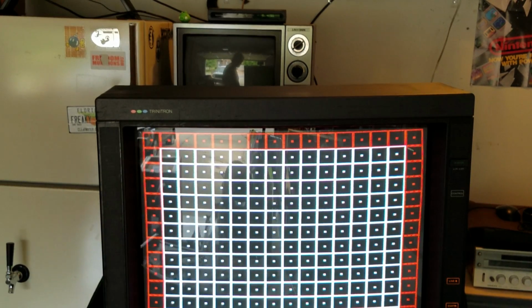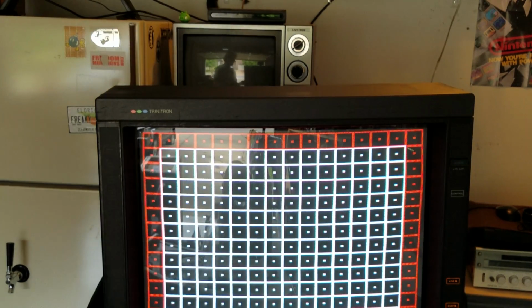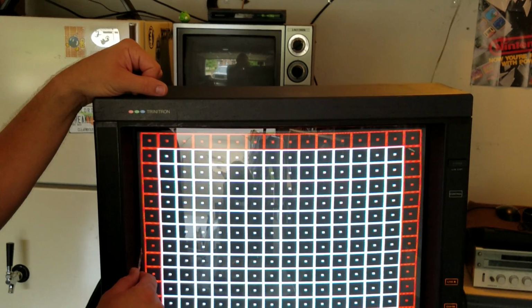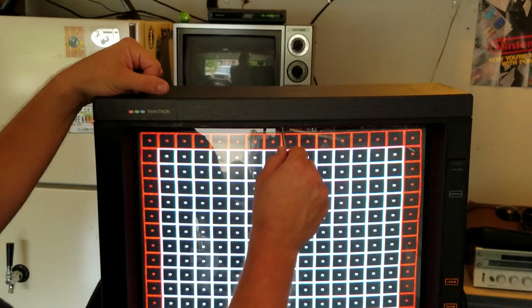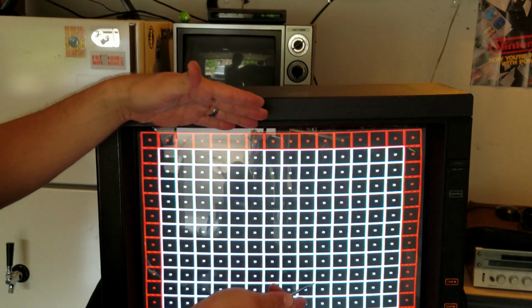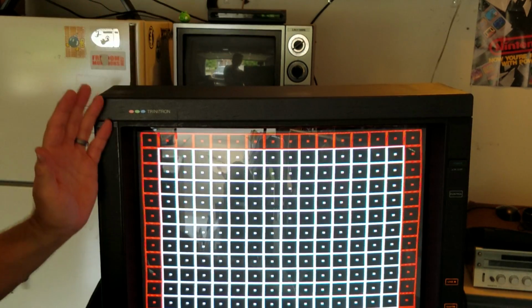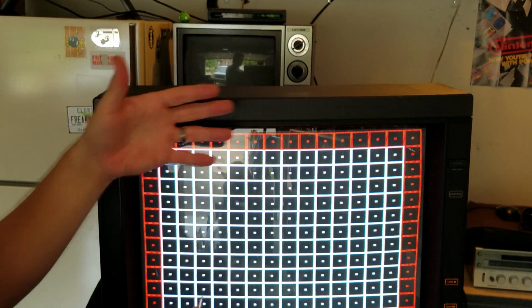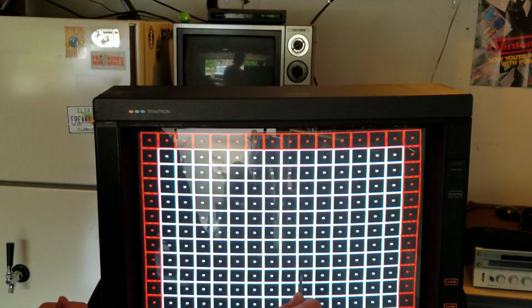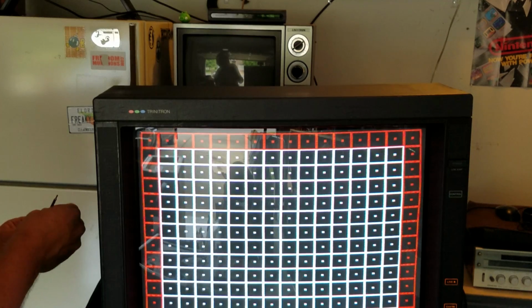Now the last step for this portion of the geometry is going to be getting this horizontal and vertical sides back out, okay? And I've left a good, I don't know, 1/4 of an inch mostly on each side. And then what I'm going to do is I'm going to actually turn my H size and my V size so that these lines are completely out of the picture. And basically what that means is when I'm running some media here, I'm going to get that overscan area. I'm going to take advantage of that, and rather than have a black bar around my picture screen, I'm going to have a full picture and no blackness around the outside of my picture.